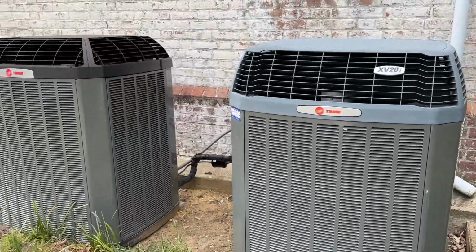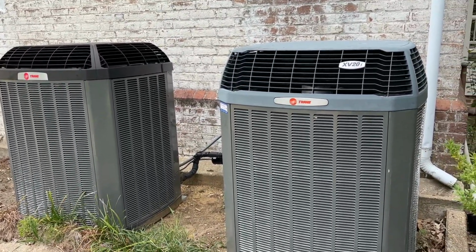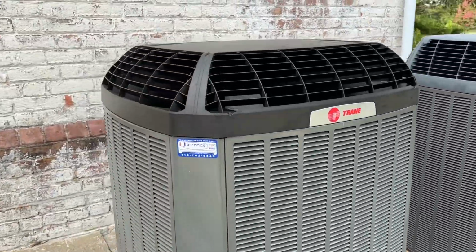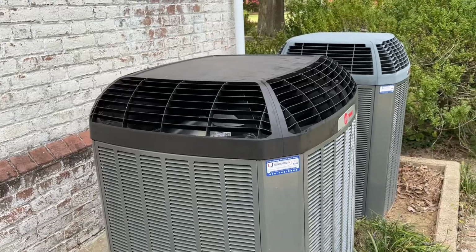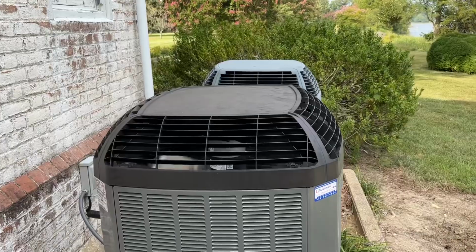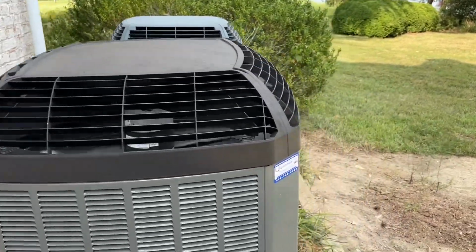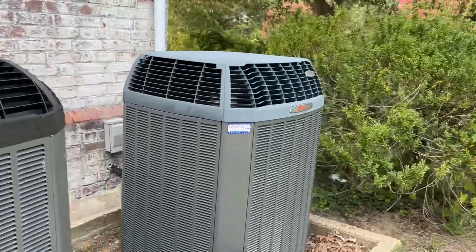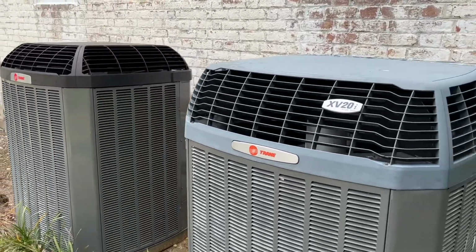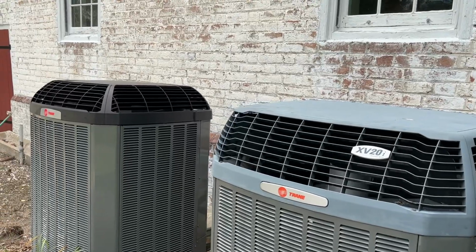They're both 3 tons. Replaced Trane XE1200 2.5 ton units, and I believe these have Danfoss inverter scrolls. No issues since installation in 2019. So they passed my 5-year test. They've been reliable, nothing's wrong with them. No issues. They handle just fine, and they're sized correctly now. The older systems were not.